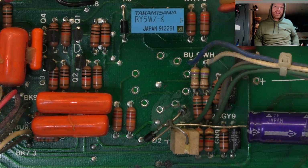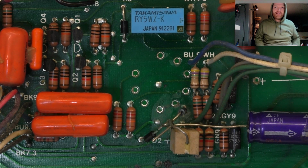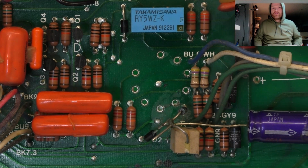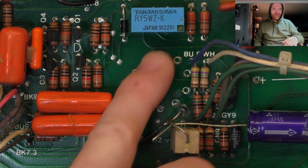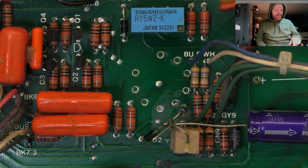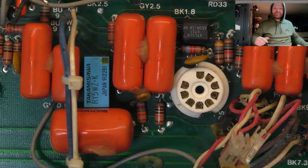Basically, on a normal board where you'd have a pad top, a pad bottom, and a tube going between them through the hole, these things just have a tube. So what do you do? Of course, that tiny little pubic hair of a pad just comes off the board, so now you haven't got a pad to solder to. So you avoid soldering to a Mesa board at all cost. It's not just the valve socket pads, tubes. I call them solder tubes on Mesa because that's what they are. Every component has got the tiniest little wisp of a pad that it's basically non-existent.